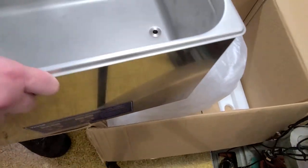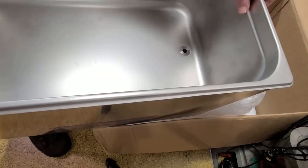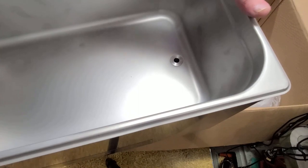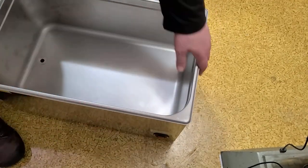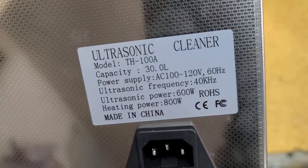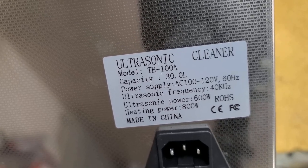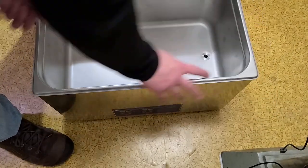It has a heater that goes up to 80 degrees Celsius or 175 degrees Fahrenheit. The ultrasonic power — that's where the money is going — they're claiming a 600-watt ultrasonic transducer, which is a lot of power. It has little grab handles on each side and a lighted power switch on the back. The spec panel reads: 30 liters, ultrasonic frequency 40 kHz, ultrasonic power 600 watts, heating power 800 watts. The website says 500 watts of heating power, so we'll have to make a determination about that.